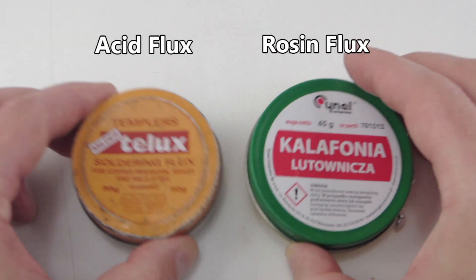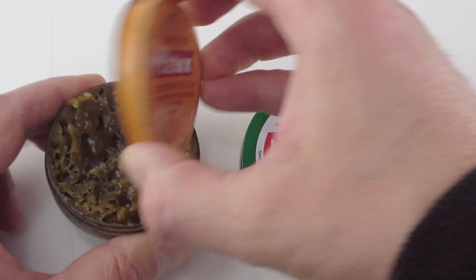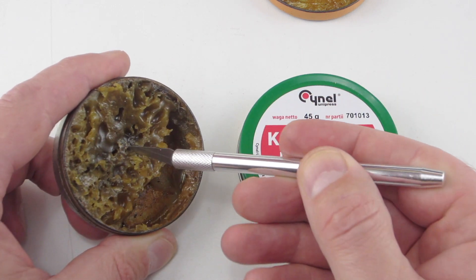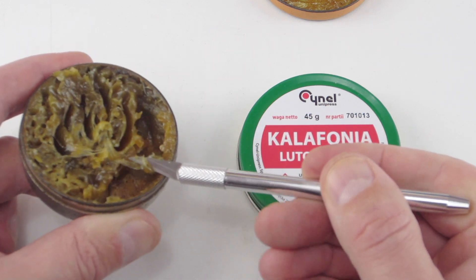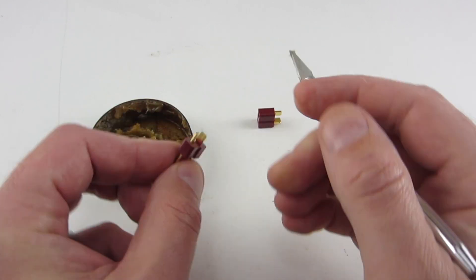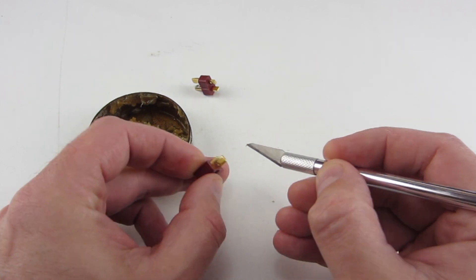It comes cored already with flux, which is a material that helps the solder stick to surfaces and flow better. But sometimes you might need more flux or a different type depending on the application. Two types of flux you'll see are acid flux and rosin or resin flux. Acid flux is more commonly used in plumbing — it's for soldering onto metal. Because of its corrosive properties it's not really advised for fine electronics work. However, for some simple jobs where you have a big metal tab to solder to, like Dean's connectors, I find it ideal — just a tiny scrape of acid flux. It has a nice aggressive etching action and the solder flows onto the tabs really well.